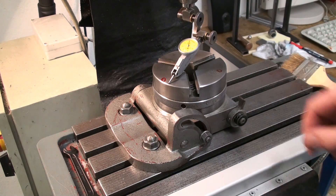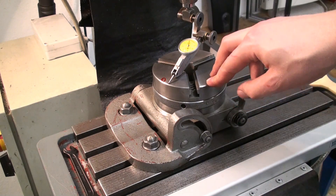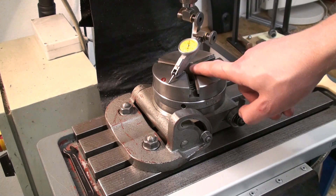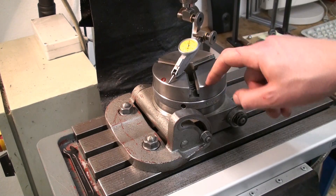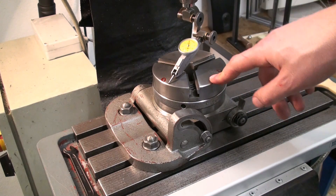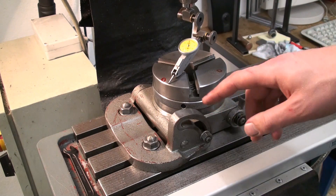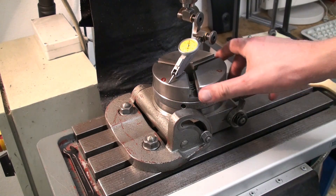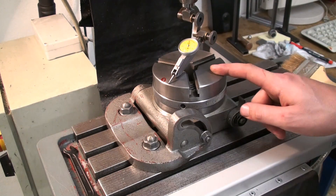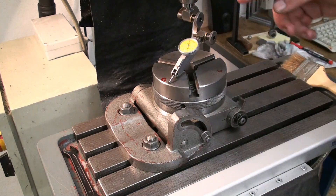To get the head sitting flat, we can clamp it in position - this is the screw to clamp the tilt motion. After clamping, I always do a double check in case something moved, but we're still flat as could be. Now I'm going to center up the dividing head. I have a bit of a problem - I have nothing to register really. I have the outer surface of the jaw and the inner bore, but those are not functional surfaces on a jaw. I'm centering on the outer diameter because it's a way better surface; the inner bore is pretty rough, almost like it's just drilled or rough-bored.